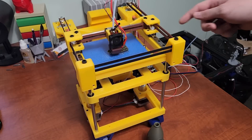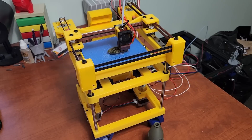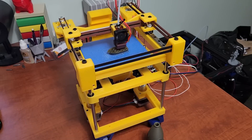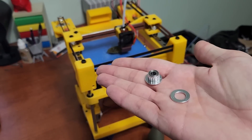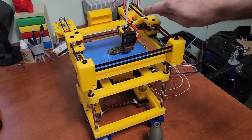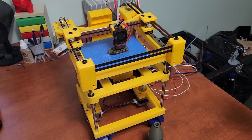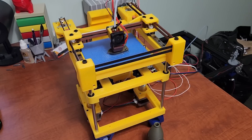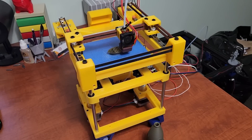Most of the parts for this printer are pretty straightforward. I'm using 20-tooth idlers — please try to buy high quality idlers like Posh or Mellow, something like that. I've definitely had idlers explode or break apart on me; as you can see here, this one literally just fell apart and I hadn't even used it yet. So don't cheap out on idlers. On the top it actually uses FR695 bearings, similar to a Voron — I prefer those and usually have them on hand. You can find them on AliExpress and I think Amazon carries them now too.